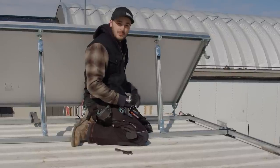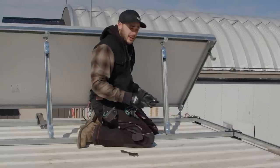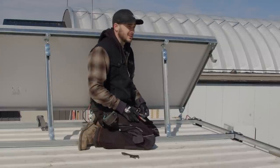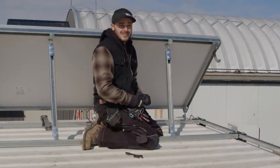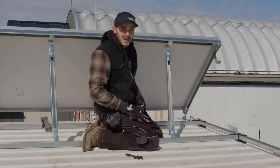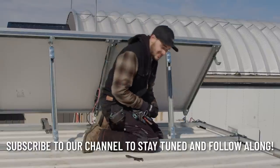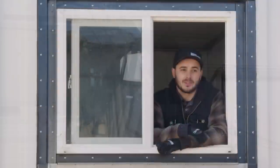This is our first off-grid office, and given this scale shack requires very little power, it didn't need much of a panel, many batteries, or a large charge controller. We are getting requests for fully functional off-grid offices, and it takes a lot of power generation to feed a couple of people working. In a northern climate where you have to generate heat, electricity alone doesn't seem like the primary heat source — you probably always need to run propane or maybe a solar thermal panel to heat water and then heat the container. All stuff we'd like to play around with in the future.